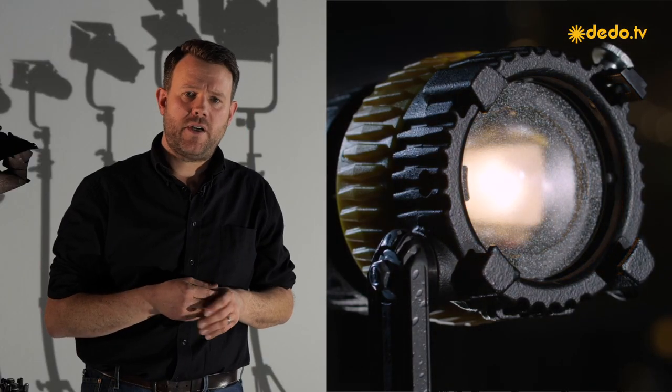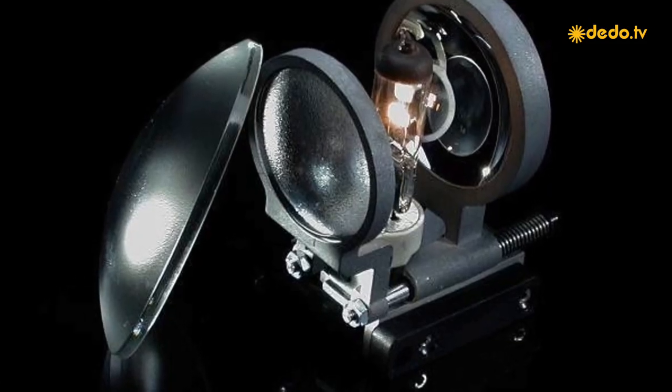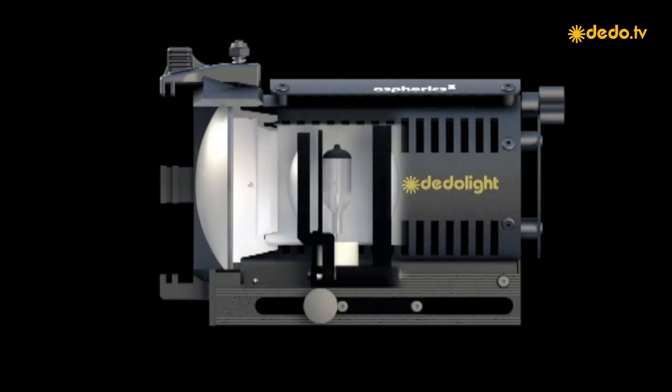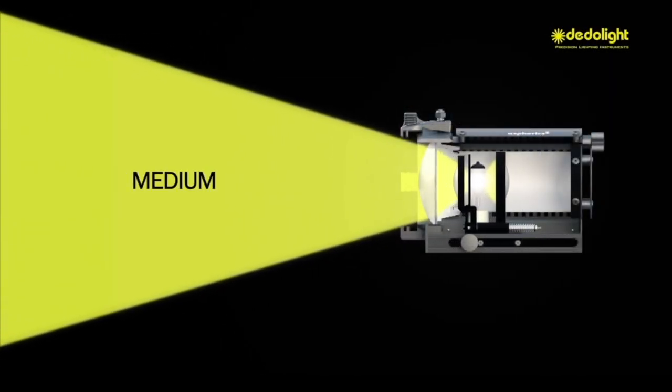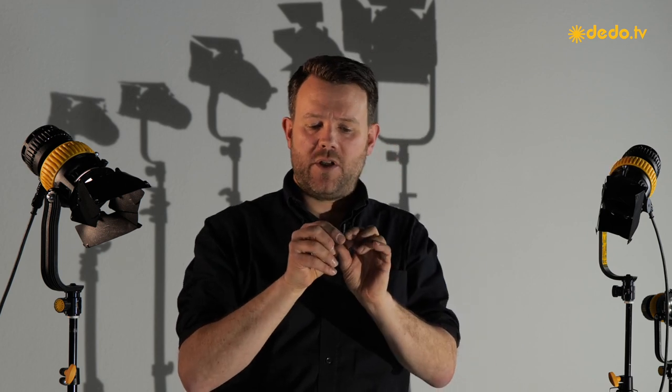As a lighting designer, I want to add my thoughts on the optical benefits of using a mono or bi-color LED system as seen in the Datalite NIO range versus the multicolor system in the Datalite NIO Color range. Optically, we always need a pointed light source — whoever remembers our classic historic lights, it was a pointed low-voltage bulb. To replace it we ideally want a pointed light source. With LEDs, the more wattage or lumens we want, we need an array of LEDs, so the source virtually becomes bigger. That's why the mono color system is always optically preferable — we get the smallest packaging.